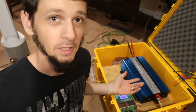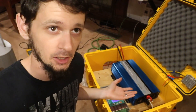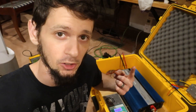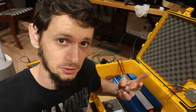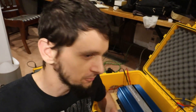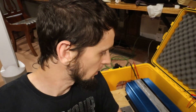Keep your runs short and your wire can be smaller, or if you want to go with big wire, that's fine — just fuse it according to what you need. This 1500 watt pure sine wave inverter works as advertised and more. It can run more than 1500 watts and can start a 5000 BTU air conditioner. I've actually started my 8000 BTU air conditioner on it. I've run both the 5000 and the 8000 — you just have to start them in a specific order: start the 8000 first, then the 5000.